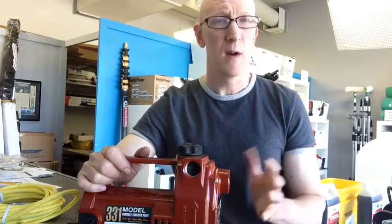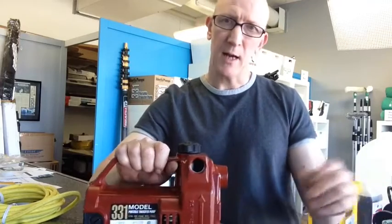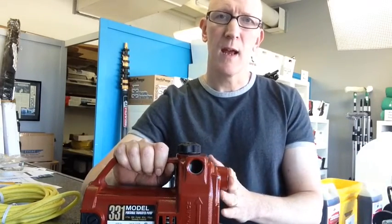But let's say you're on a particular job site where they have some low water pressure, or you need to go up high — four, five, six stories. What you would do is take your line from the house or the commercial property that you're cleaning, go to the input of this pump, and then from the output, go before your RODI system.